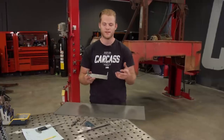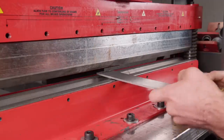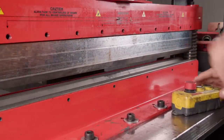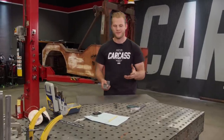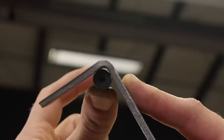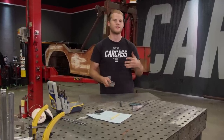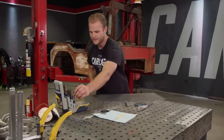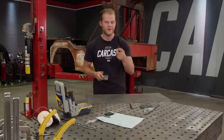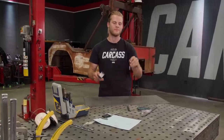The reason we need to know the inside radius is because there's a specific amount of material taken up in each bend. To accurately place our bend lines on our flat sheet, we need to know what this radius is. So we need to make a test bend and grab a set of drill bits. Now that we have the test bend made, take the shank of a drill bit and put it on the inside radius of the bend. Look up at the light — if the drill bit is so big that there's an air gap between the inside radius and the shank, keep going down in drill bit size until that air gap is no longer visible. A 17/64 drill bit closes that air gap. Since that's a diameter and we need a radius, 17/64 divided by two is 17/128 — and that's going to help us figure out where to place our bend lines on the flat sheet.